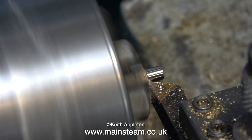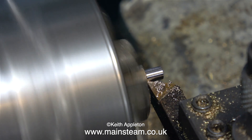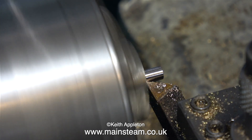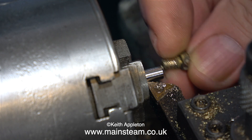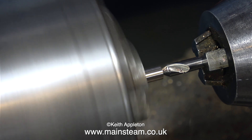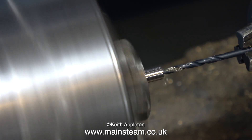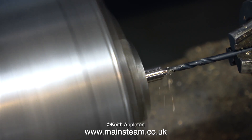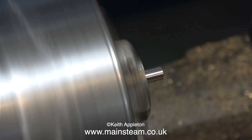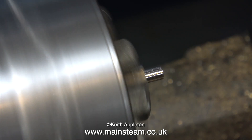I'm using the original gland nut as a gauge. This phosphor bronze is not leaded phosphor bronze — it's the old-fashioned red stuff, and although it machines okay, it can be fairly horrible when you come to drill holes in it because it gets very hot. Often when drilling holes in this type of phosphor bronze you can see it change color with the heat, then it grabs the drill, then the drill snaps off. Lathe coolant or at least oil is recommended, but I'm not bothering with this part because it's very small and I don't have to drill very far down it. I use a center drill first, and now I'm using a 3/32 of an inch drill to enlarge the hole and drill it all the way through. The good news is that this 3/32 of an inch drill drills fractionally undersized, so I'm going to put a reamer through once the hole is drilled all the way. The hole is drilled.